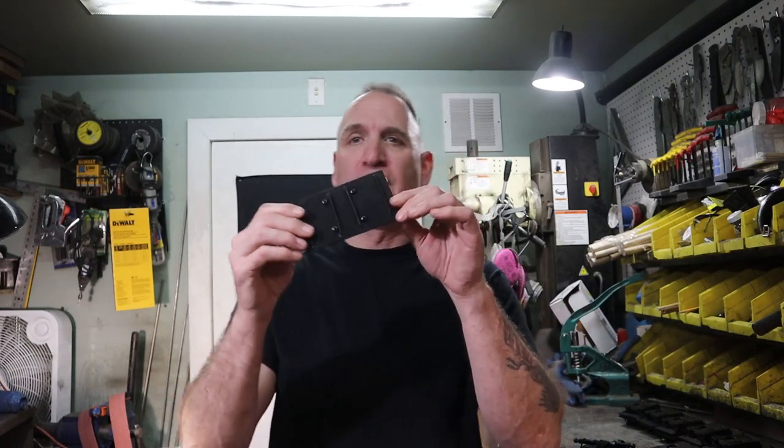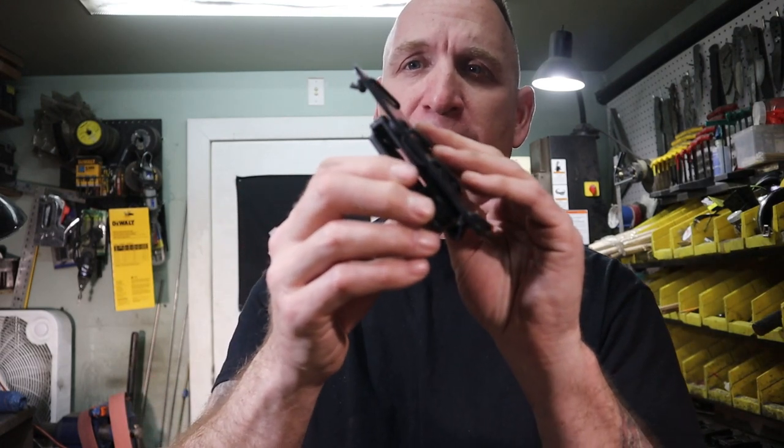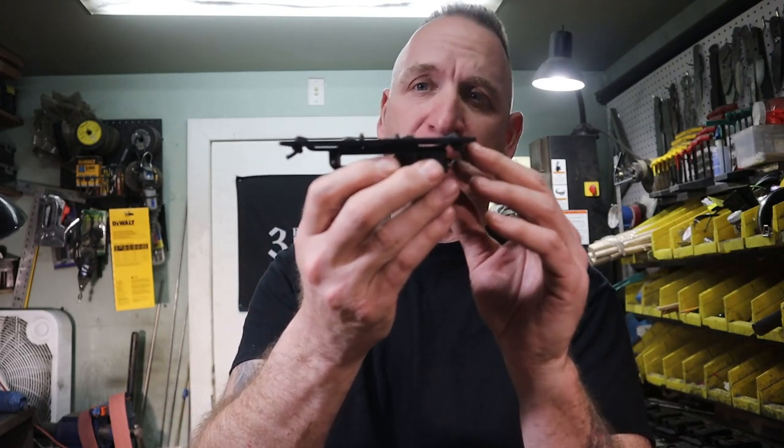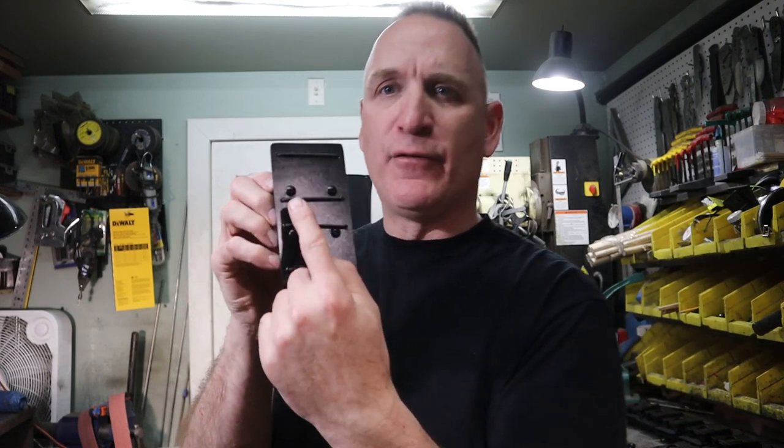I developed these tourniquet cards. They aren't anything special — it's basically a very thick piece of kydex that is five inches by three inches. This one is 0.125 inch, which is about an eighth of an inch — a very thick kydex. The kydex I used to make these before was a regular plain 0.080, which was fine, but the problem with the 0.080 is that if you put a lot of pressure on it, it will bend. With these, it's very difficult to bend.